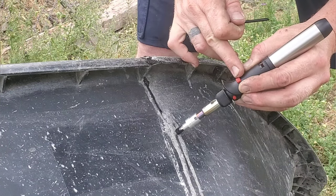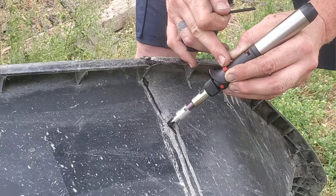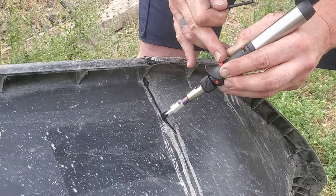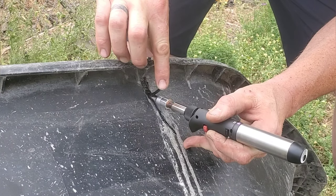If you're really worried about the crack continuing, it's probably a good idea to get a drill, find where that crack almost ends, and put a drill hole in there. That nice round hole should stop the crack if you get it at the end of the crack, or you can just weld a little extra past it and hope you got it — maybe make a couple passes over it.